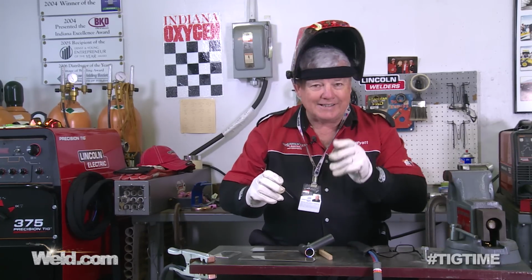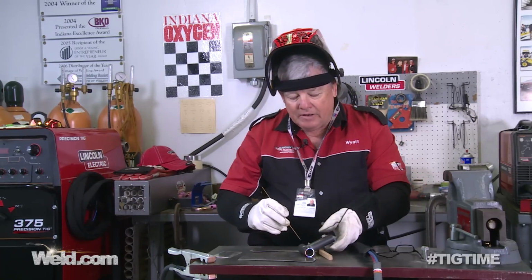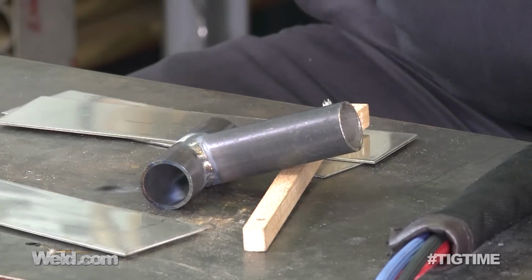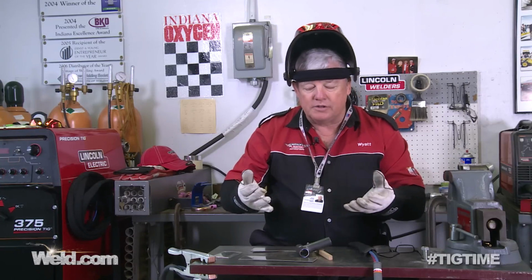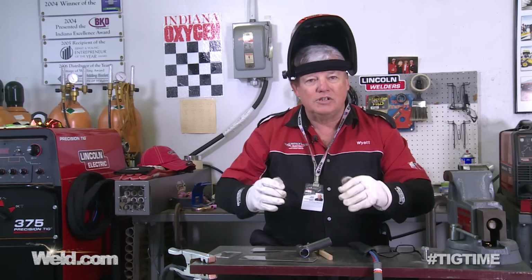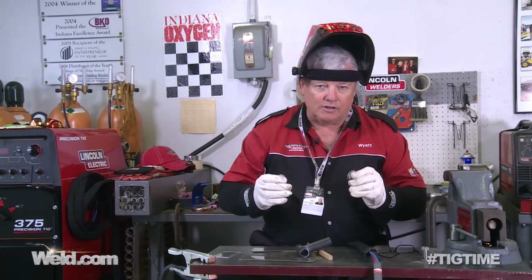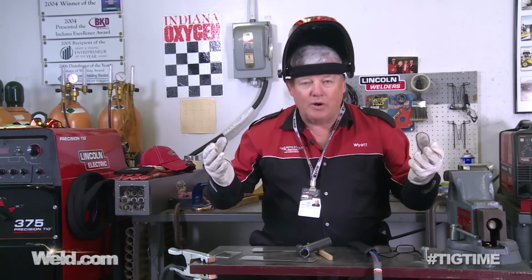So we're going to test the guy and see if he really can see the difference in thickness. Now, he's also going to be able to tell you whether this surface condition is real or not. If you have these little spiders that look like cracks, a lot of times all it is phosphorus and sulfur that's come to the surface, a little bit of surface contamination, and all it's done is come to the surface and re-solidify and it cracks. It's not a bad thing, it just looks ugly. So you really can't look at it and say absolutely it's a crack or it's not a crack.